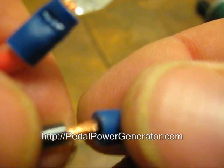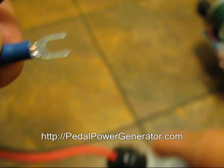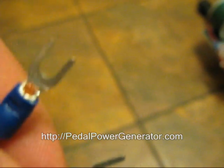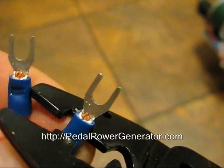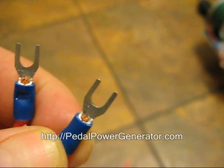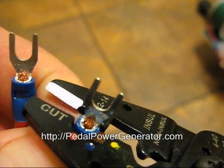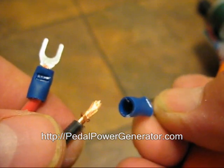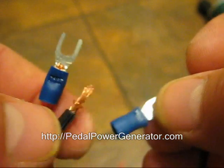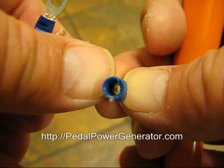Here's the next one. Make sure you put these on the generator side of the wiring. Same thing again. Make sure it can — there we go. One, two, three, and smash. Do a test. See, now that wasn't a good crimp — it was crimped too far forward. You can pull that right off. You can't really reuse this because it's already been crimped; you have to throw this away and get a new one.